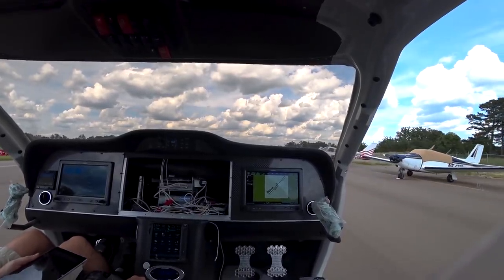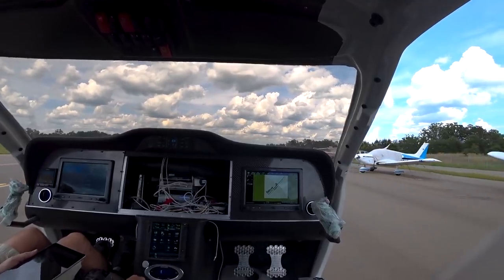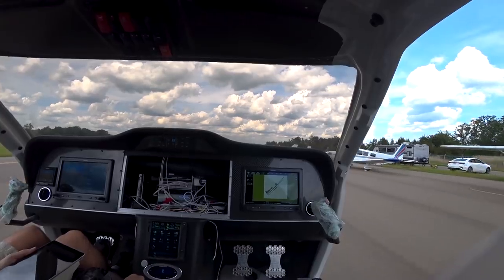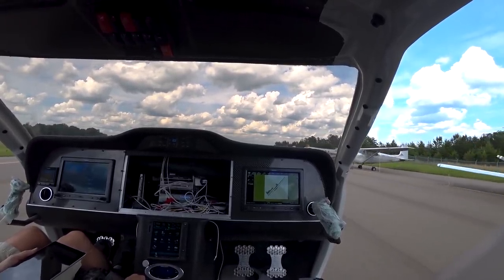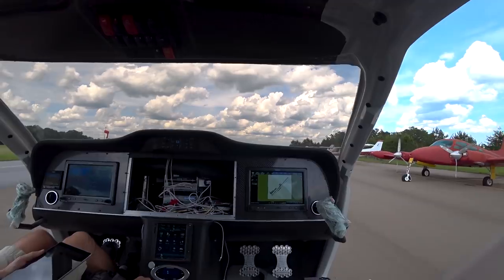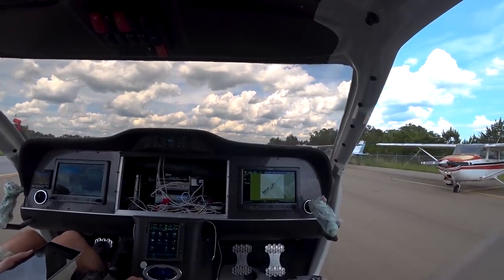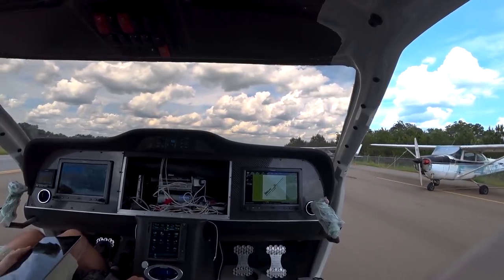As you can imagine, I'm really disappointed about that redrive, but right now we just have to push on with the fixed pitch prop. The reason the center section and the panel are missing is because I've figured out the problem with the interference on the radio. It's actually the Wi-Fi hotspot, so I'm probably going to have to change that out and use a regular Wi-Fi router for routing the data from the ECU. Apart from the redrive, I'm happy with the progress so far.